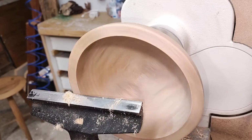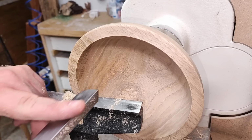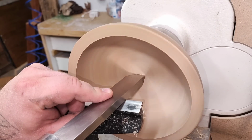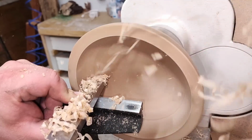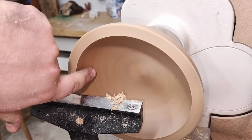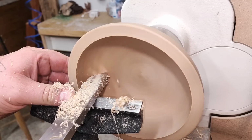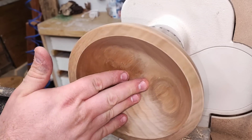Now I feel that this burr isn't as sharp as I would like, so there is a slight rougher spot here, hope you can see. So I'm just going to quickly go off camera, I have multiple videos on how I burnish the burr here. A burr here straight from the burnisher, and I'm going to go one more time. So that vibration, high pitched sound, was me pushing just a little bit too hard on the side wall here. So again, okay, that feels really good, and we'll see a slight improvement in the surface here.